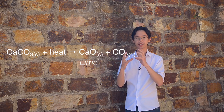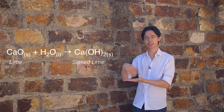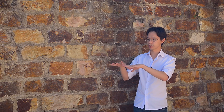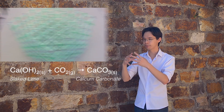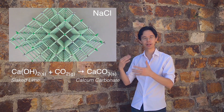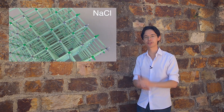The calcium oxide is the lime, and when you mix that with water you get calcium hydroxide — a white slurry mixture. If you let the water evaporate and dry, once the solid can get in contact with the air it will absorb carbon dioxide back into itself and form a crystal lattice. When it forms a crystal lattice, if you've got aggregate like stone, gravel, and sand, it'll trap those bits into it and form a very strong piece of composite material.